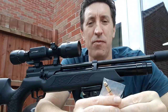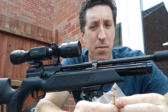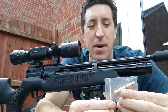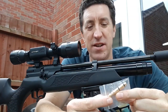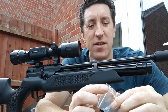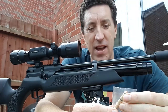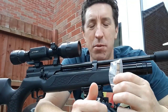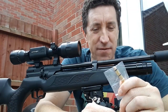How did I fix that? Well, you'd think it's easy to just replace the seal, but I didn't have any spares. What I did have was the original threaded fill probe the gun came with — this other one I bought separately with a quick-attach fitting. So I swapped the seals over from one probe to the other and now it works beautifully. That was an easy fix.